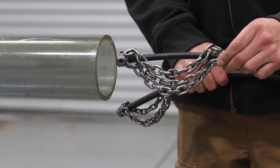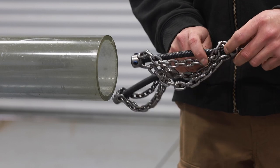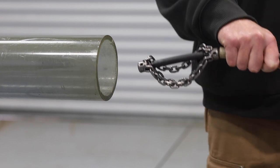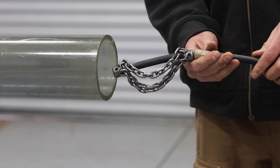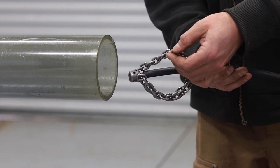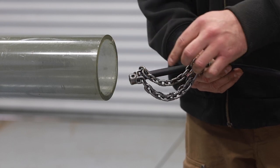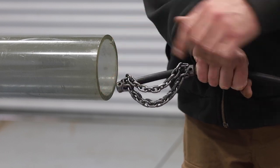Once I get my chain to that hammock position, what I really like to do is spin the chain right outside of the pipe before I go in, so I know if I need to adjust it one way or the other. Those were all sixes — this is a four, so I've got this on a mini miller with the PVC chain. When I spin it, you should see that the chain is a little bit wider than the ID of my pipe. If I were to clean this pipe with it set exactly at the widest point, really all I'm getting is a lot of work on one link — it's going to wear your chains out very quickly. So we want all of those links working, which is why we oversize it a bit. You could even make it a little bit wider than the outside diameter, depending on the pipe wall.